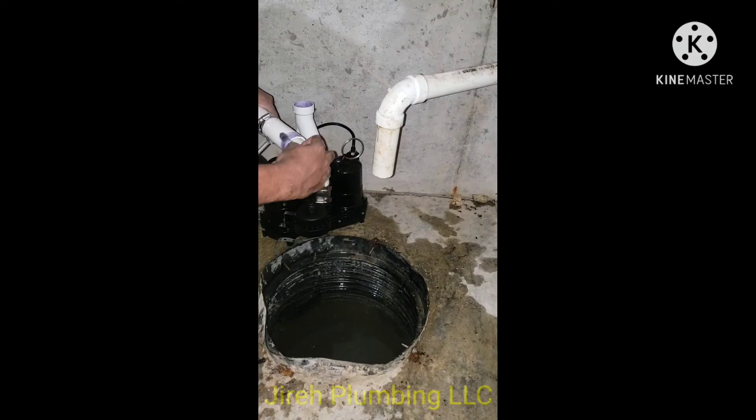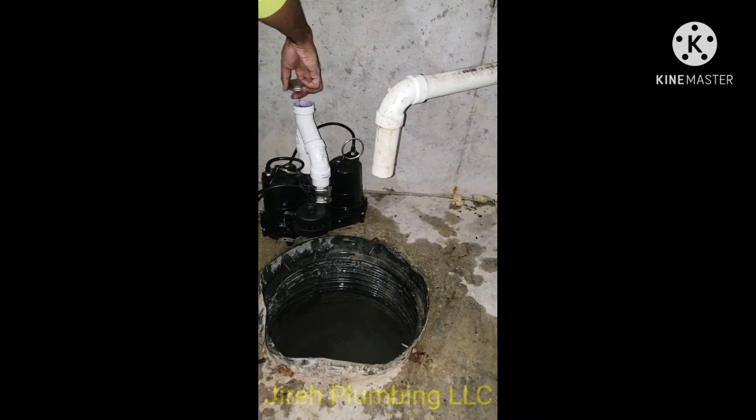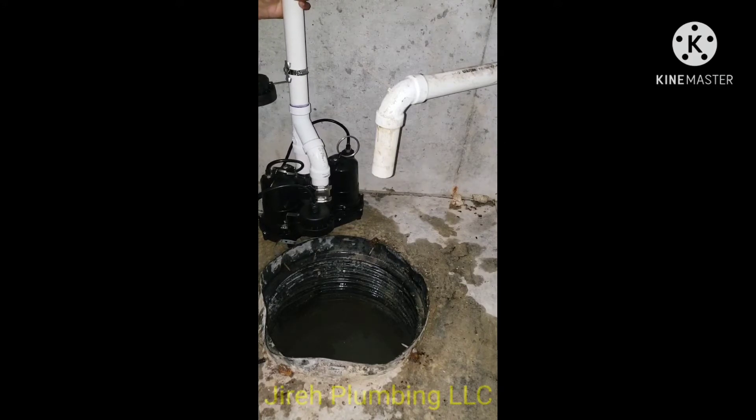You always want to put some type of brick down there. Because his water table is so high, it covers his drain going into the pit by at least two inches, which is not normal at all. So I put a cinder block in there to raise it up higher so the pump doesn't just keep cycling on and on — it's not meant to run constantly.